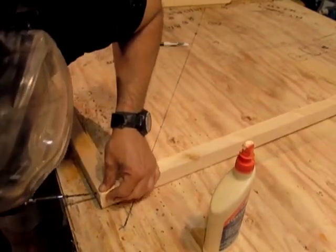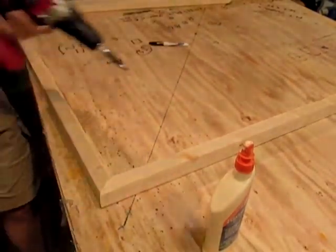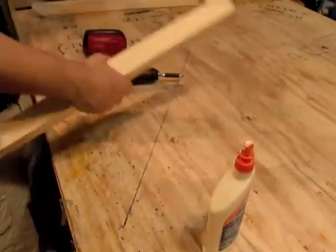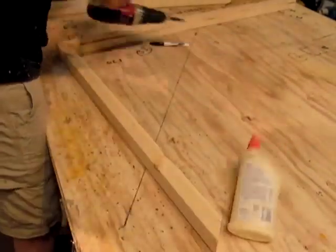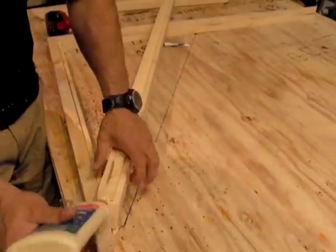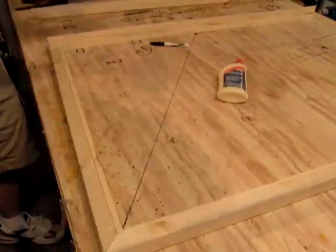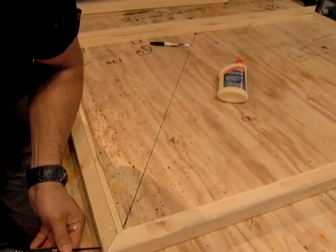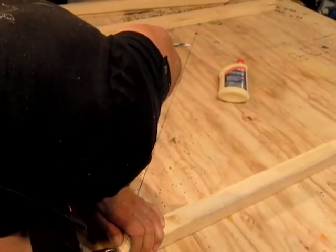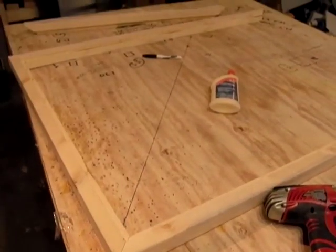You want to be just a touch short — it's going to pull, and there you go, your corner is done. If these are a little bit off it's really not a big deal. Then you just flip it, put glue on the next one. This is why you don't want to put a hole here or you won't have anything to drill into. Line these up. The reason you have to pre-drill is it'll split this one side right out if you don't. Grip it, make sure it's nice and tight, and there you have two.